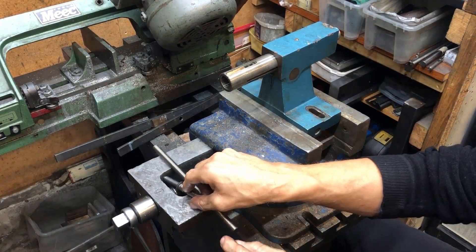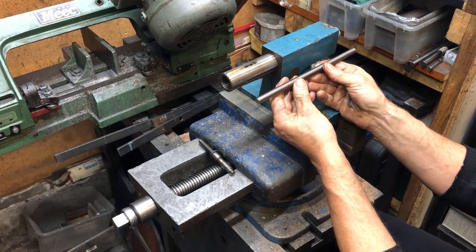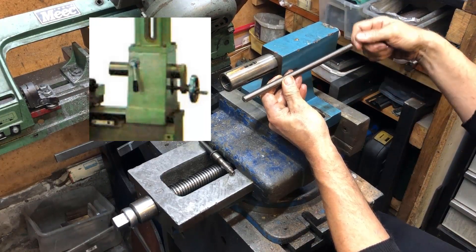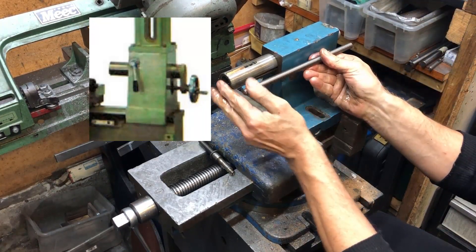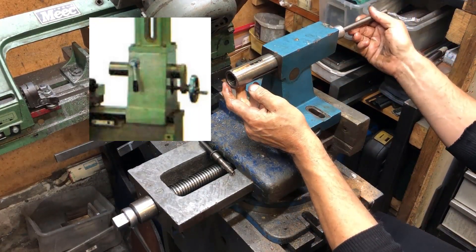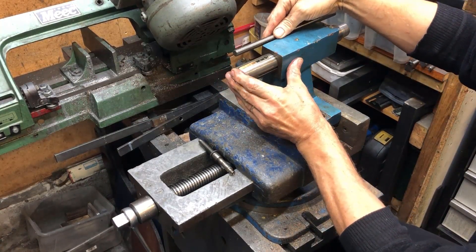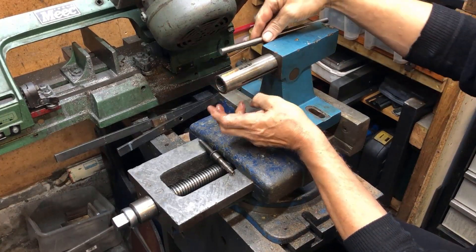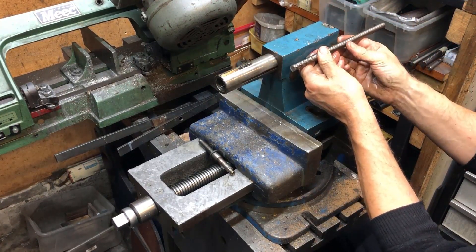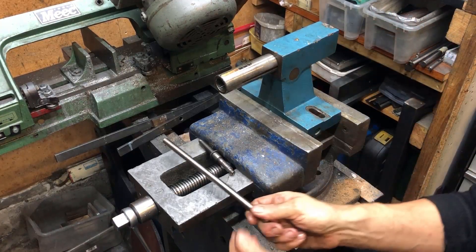At this point I wasn't sure exactly how I wanted to do this modification. I've seen other systems where you have an externally mounted screw — either on the front, on top, or at the rear — with the handwheel aside of the center of travel. That could also be a way to modify instead of having it central. With such a design, the nut would be fixed to the tailstock body while the screw moves back and forth with the barrel, though at fully extended travel that may be a little bit not exactly ideal.